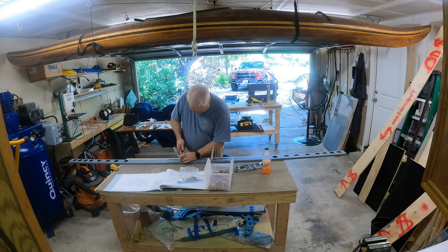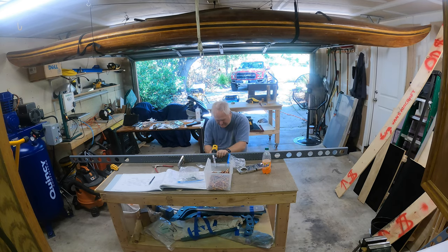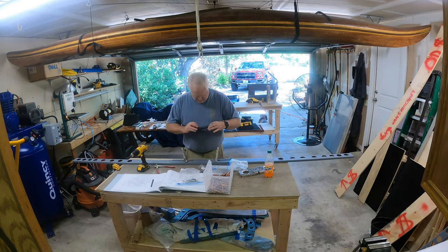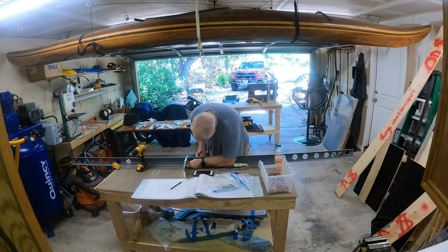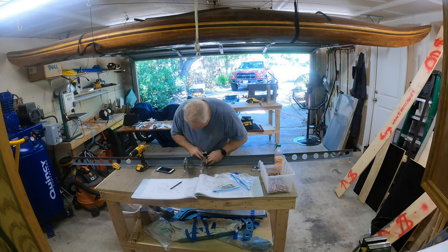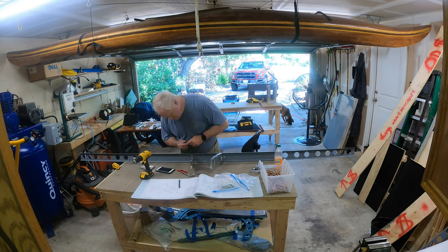These are the innermost ribs. Here I'm continuing on attaching the nose ribs that I just modified to match drill a couple of number 30 holes that aren't on the rib. And then as soon as you're done with match drilling those holes, go get the HS1004 ribs and match drill a single number 30 hole to the rib. I found it easier to remove the 905 nose ribs so I could get easy access to the hole I had to match drill.